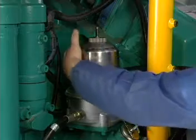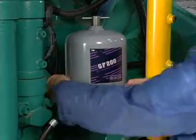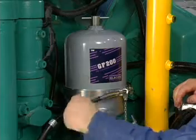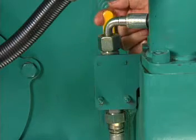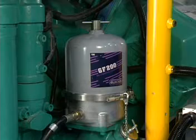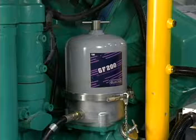Install the rotor on the spindle, making sure it spins freely. Then replace the cover. Properly tighten the clamp and T-nut that secure the cover. If the shutoff valve was closed, reopen it. Within a minute or so of reopening the valve, or as the engine nears operating temperature, you should feel the cover. If the unit is operating properly, the cover will be warm.